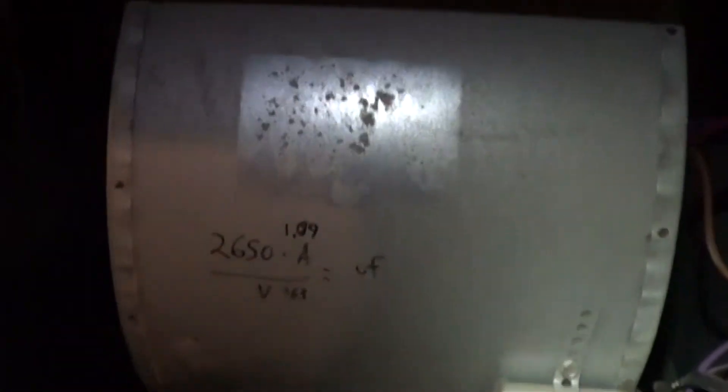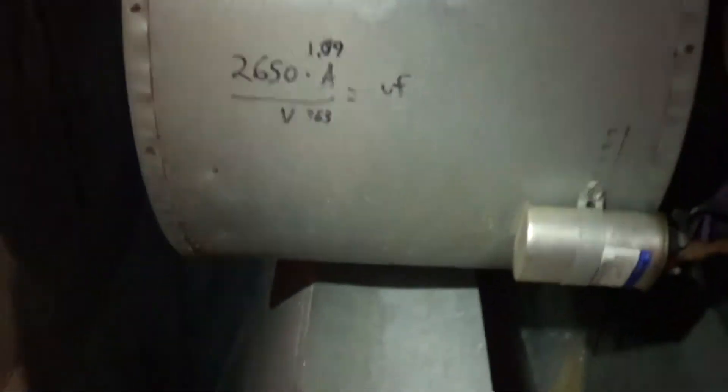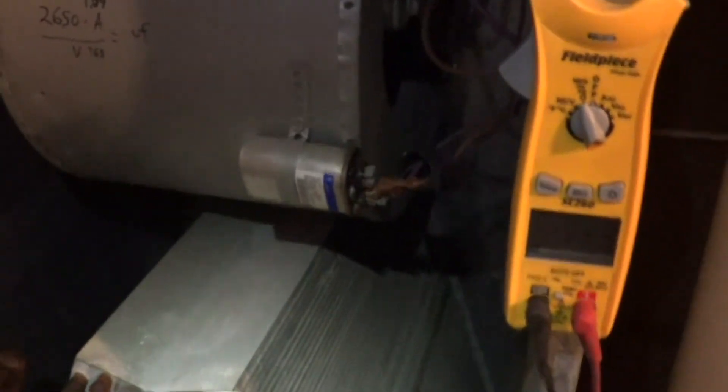You can read these capacitors either by shutting it down, pulling the wire, and using your meter on microfarads; or use the reactance formula, which is basically Ohm's formula. This number comes from the 60 hertz frequency — capacitors are basically a resistor for a frequency, and they reduce the current flow. Just memorize 2650 times amps divided by volts. If you get it wrong, you'll be way off. And you can check without having to kill the power, which you definitely want to do safely — you need to be a professional.